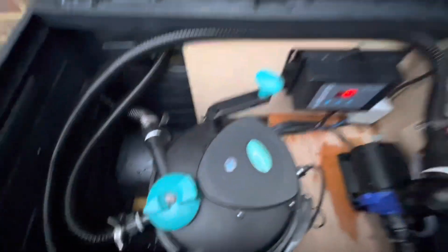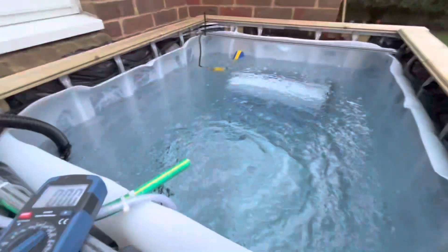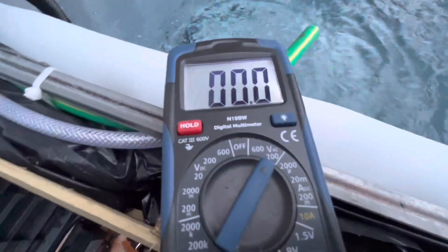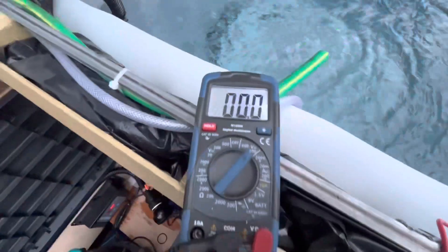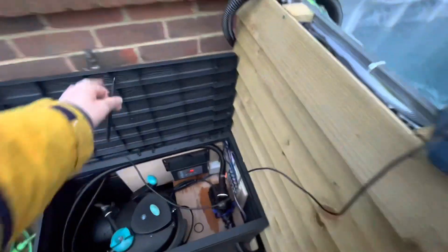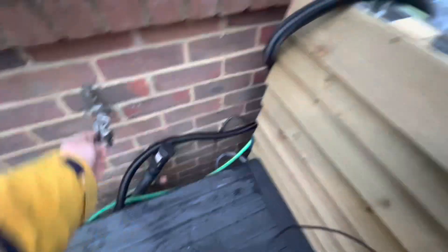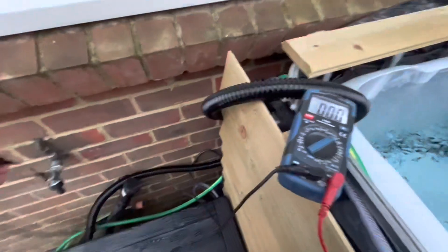UV, pumps, and air are all now working. I've basically got a voltmeter here set up for alternating current — which is mains — and I've just put the positive electrode into the tank. There are two ways I'm going to do this just to be safe. I know my house plumbing is earthed, so if I touch the negative probe on that it will create a circuit, and if there's any voltage going through the pond this will show it.